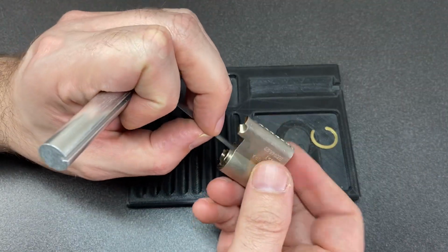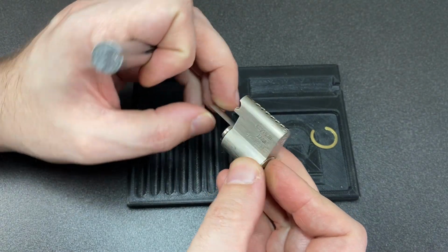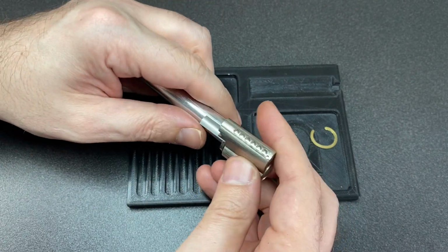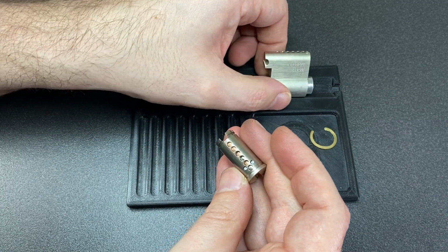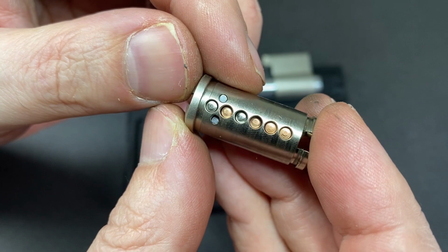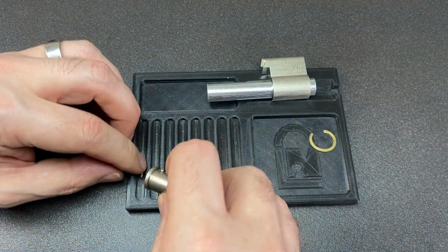Interested to know, it felt honestly just like spools, like they were relying on the keyway to provide that extra bit of security. So 6 pins. I can already see that we've got a mixture of brass and steel. Steel being sort of an anti-drill element.